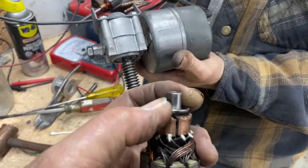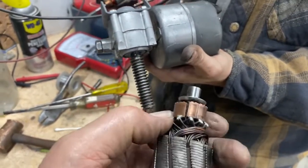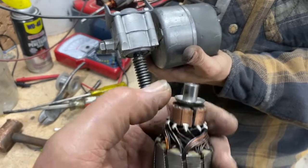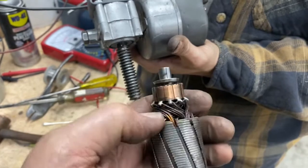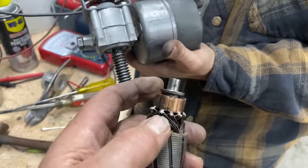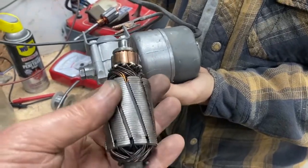And that is, we pull this washer off the back, counter bore underneath the commutator, and then reposition it and fill it in with high temperature acrylic plastic, methyl methacrylate. And now that's what we've done to the armature in this motor.